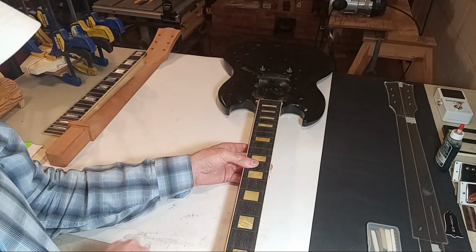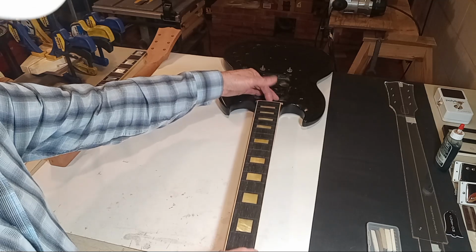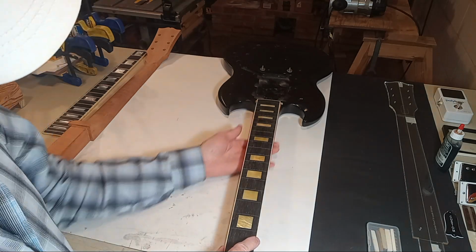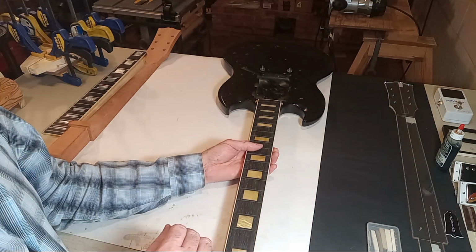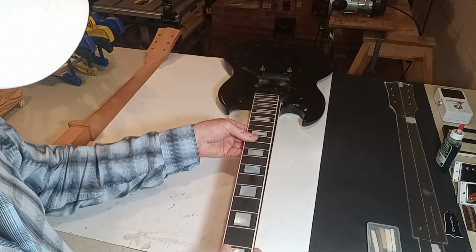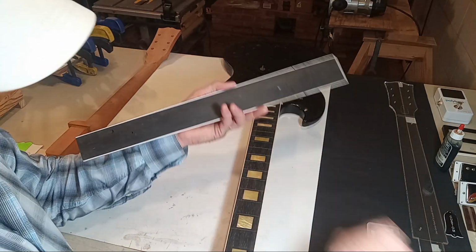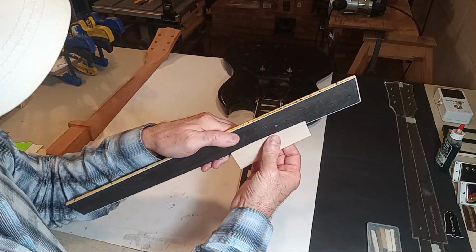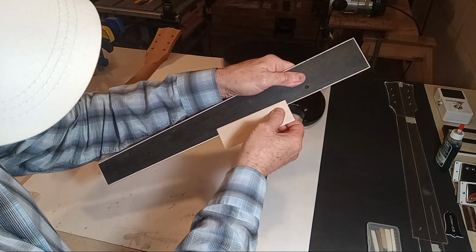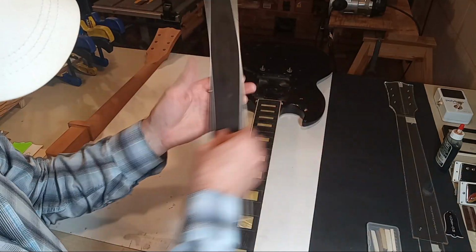I'm flushing out perfectly up here at the nut location. I'm perfectly on center and everything's getting glued in, perfectly flush back there based on the end of that. And then I'm able to just glue it all in. And you want to have a caul, C-A-U-L, a clamping caul that looks basically identical to a fretboard, but I do this from time to time, but only about this amount right here, not much. If anything, you want to guarantee that you have a strip of material like that all the way down the side, on this side, and then all the way down on this side.